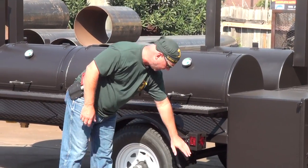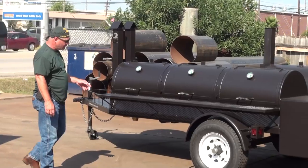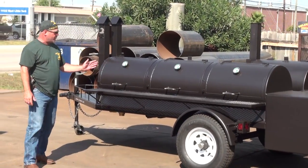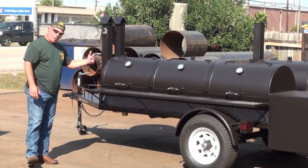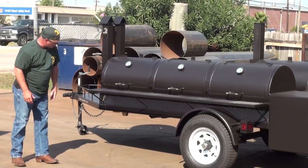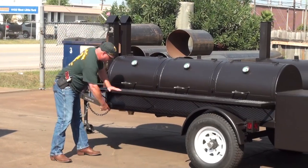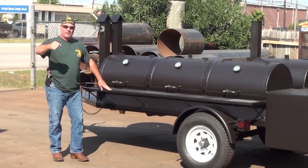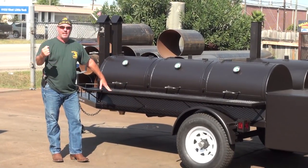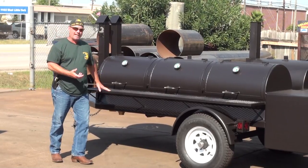You've got your license plate hanger. We fabricated everything on this pit from the trailer to the pit. Under the trailer you've got two inch by three inch, quarter inch thick square tubing to reinforce it across the trailer frame. You've also got a two inch ball valve drain down there — makes it easy to open and close, especially on a trailer. Just reach down, grab that ball valve handle, and a quarter turn opens and closes it, as opposed to having to get under the trailer to remove a steel cap.